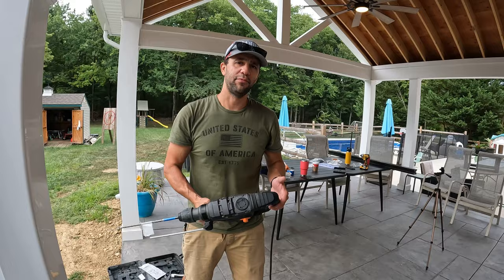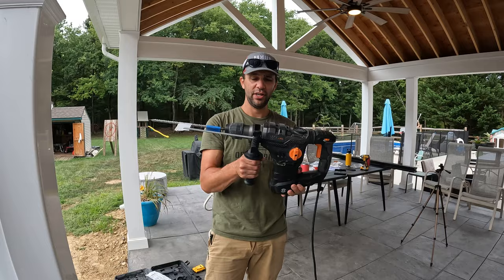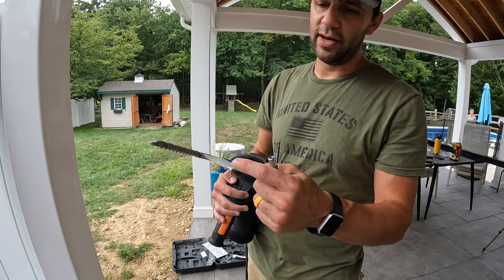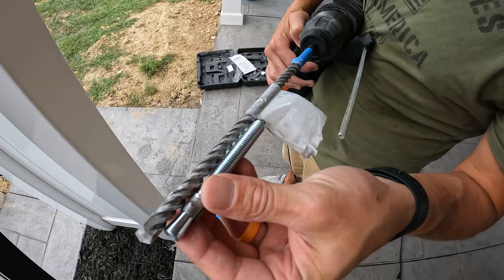For this job you don't need a huge drill — you can use something like a DeWalt drill with a hammer option, but a bigger rotary hammer makes it a lot easier. I'll put a link to it down below. This is a three-eighths SDS bit made by Bosch — I'll put a link to that in the description too. Now, what's the tape on the bit for? The tape is to mark our depth. My depth gauge won't go all the way there, so I used tape — blue tape first but it moved, then switched to Tyvek tape. You want to go a quarter inch further than the actual wedge anchor length.